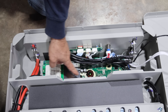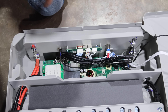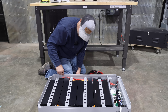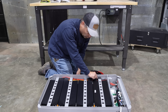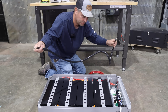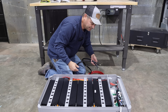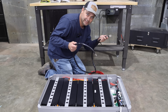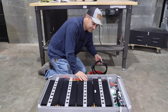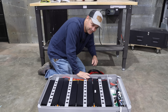Here's a better look at the top: you've got your battery management system at the bottom and the communication board on top. Every one of these connectors is glued in place on the circuit boards. Overall I do not see anything necessarily bad or any red flags. Many battery manufacturers use parallel cables like this. I would prefer one large cable, but it came with these 1-0 battery cables which are actually nice super flexible cables. It would be nice if they used the same size cable on the inside. That's not a dig at SunGold Power specifically — a lot of these batteries are that way, probably saving money — but bigger gauge on the inside would be a nice change.